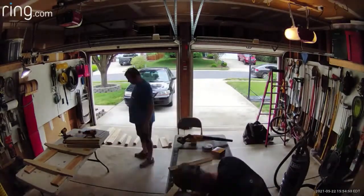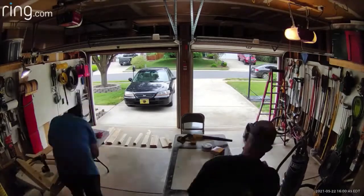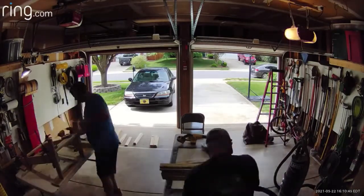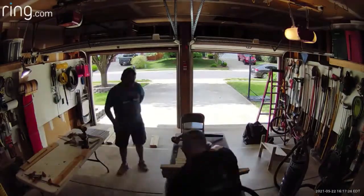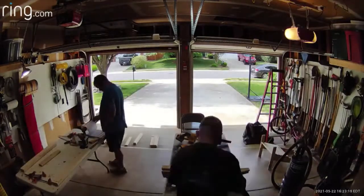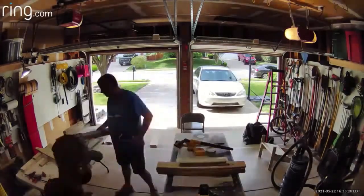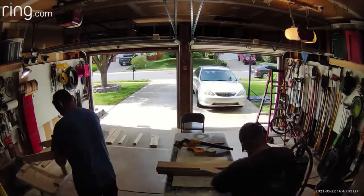I'm starting to build the chair now. This is the two legs and the seat slats. Having the shop vac hooked up to the palm sander really eliminates a lot of dust, which helps your lungs but also helps the sandpaper last longer and do a better job since there's no dust gumming up the paper — but man is it loud. I'm sure my neighbors hate me right now. So I built the first chair — you'll see it sitting on the ground over on the right. Now I'm repeating that same step for the second chair. Each screw I put in I clamp first so that the screw holds it nice and tight.